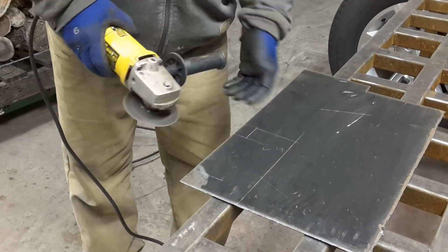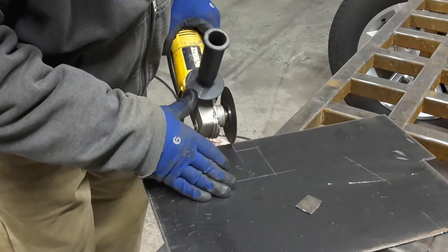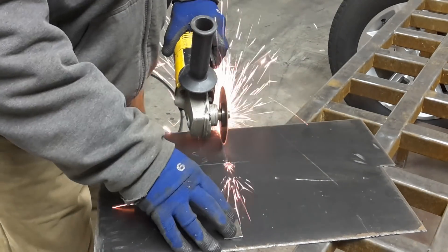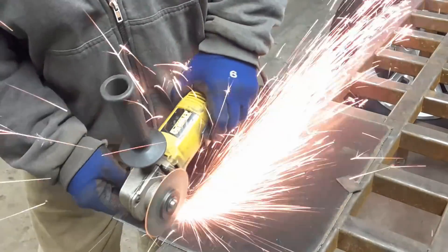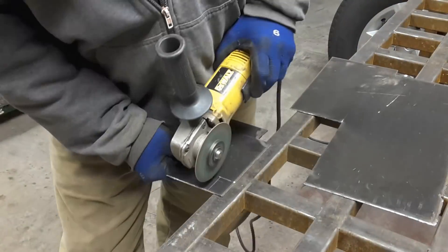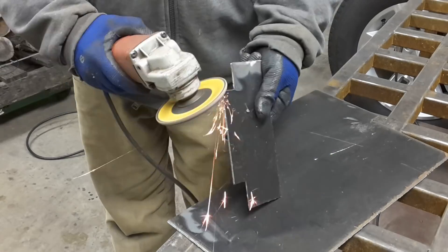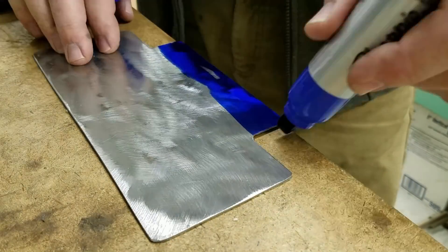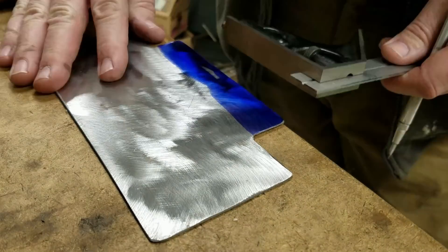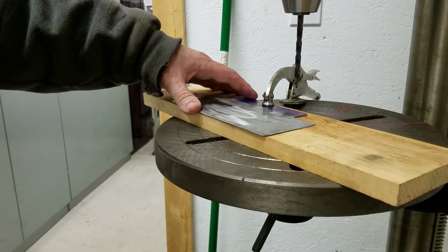Now that the intro fiasco is over, the first thing I had to do was cut out some sheet metal that I was going to use as the mount for the tube. Believe it or not, dreaming up what I wanted to do to hold the tube has been one of the delaying factors for actually doing this project — I've had the stay-put hose for quite a while. With the part cut out and deburred, I rounded over the sharp edges, then used a Sharpie as a bluing substitute and laid out for a couple of quarter-inch clearance holes. Quick center punch, clearance drill, and drill.